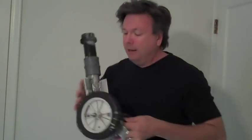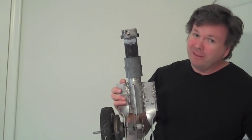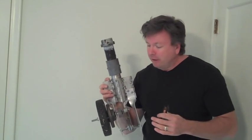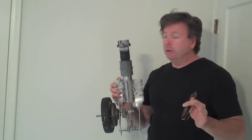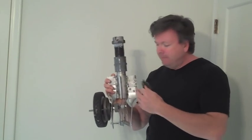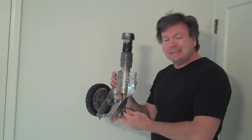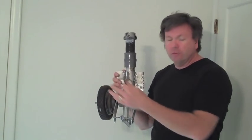Here at Volo, we've created a prototype engine — I have one right here. This is our prototype Volo 1. It's an ugly looking beast, but it runs, as you'll see later in the video. It's very simple, made of low-cost everyday materials. You've got plumbing pipe here, two pistons within that plumbing pipe. This is a flywheel and you've got some Lexan kinematics for translating it into rotational motion.